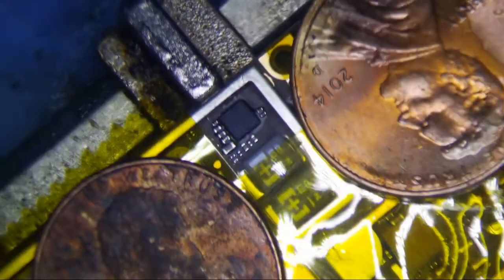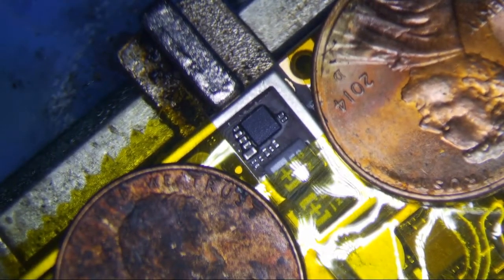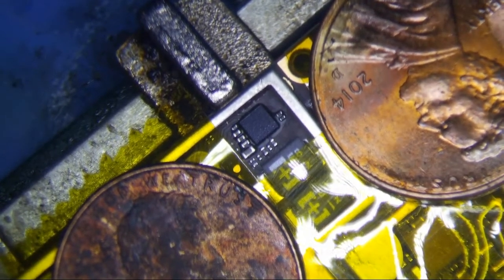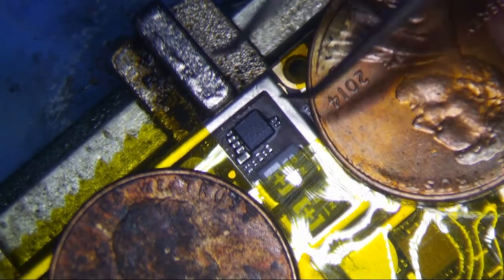Could be maybe a NAND error or something like that. But on top of that, the home button connector is busted, so I can't really do a DFU. And I don't really want to fix the home button connector until Tristar is repaired, right? Okay, so...